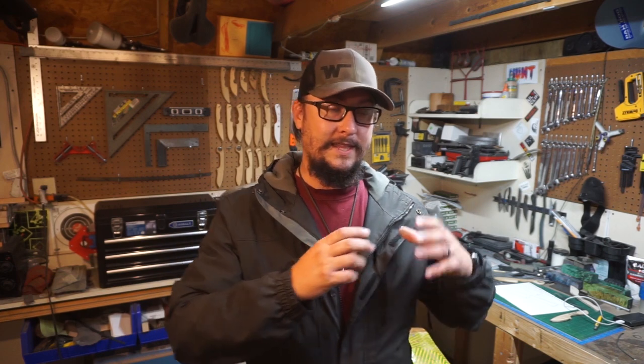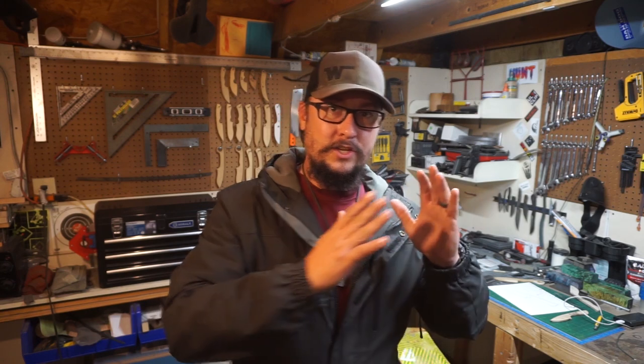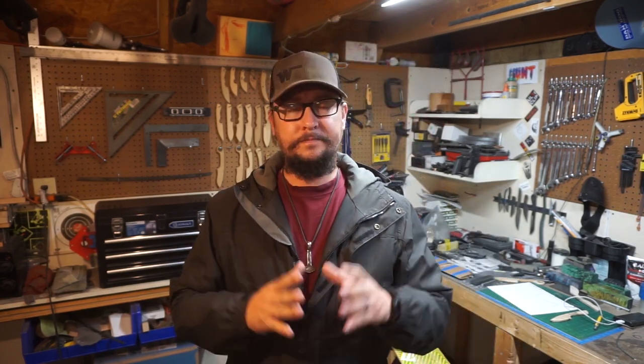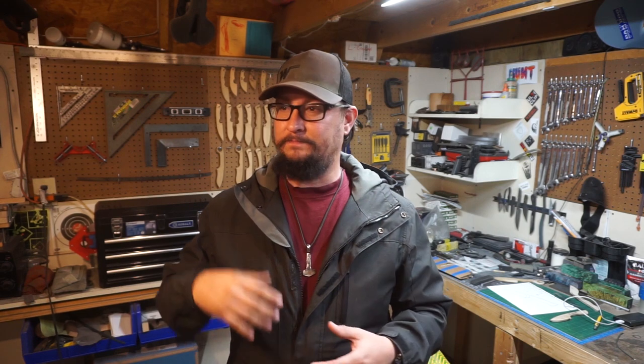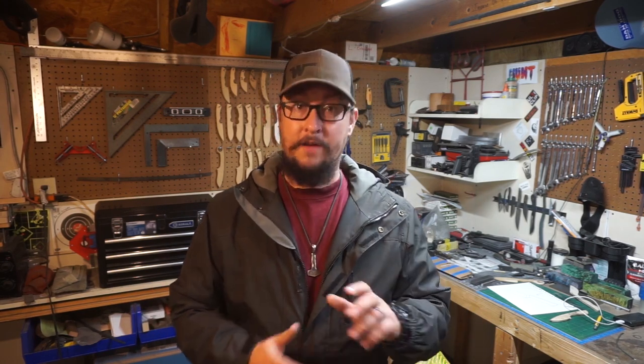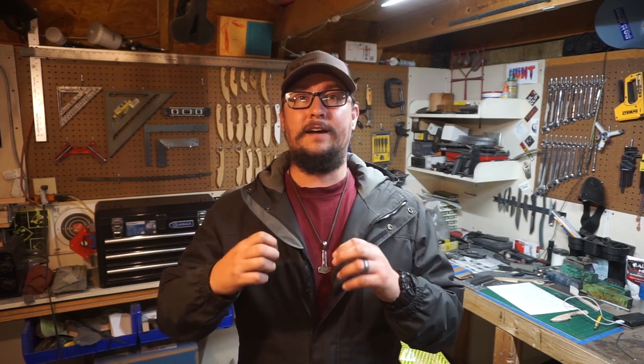Now, in this video, we're gonna focus on a couple of things. What is super important is to have the most forgiving heat treat possible. A lot of people talk about how you're gonna heat treat, what you're gonna bring your knife up to, what you're gonna quench it in, things like that. And then every once in a while, you'll see somebody say, well, the process starts with normalizing. That's not always the case. Not everybody tells you that that is the beginning of what leads to a good heat treat.